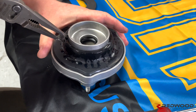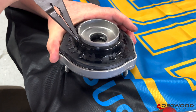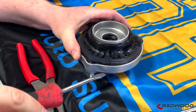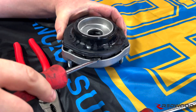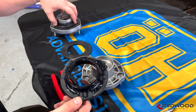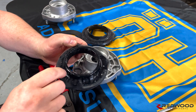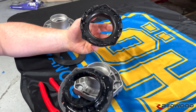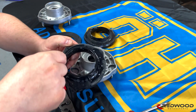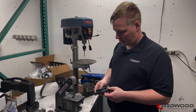You can see this one's already starting to pop up. Once you've got it up about here where you can see that spot in there, take advantage of that — get your flat head in here and pry that guy off just like that. That's the first step. Now we want to make this one look more like this one. Basically what we need to do: there's a black plastic ring inside here that we want to leave — that'll help locate our spring — but this rubber or silicone here is too large and needs to go away. We'll show you how to do that next.